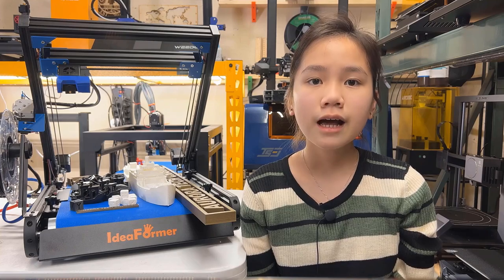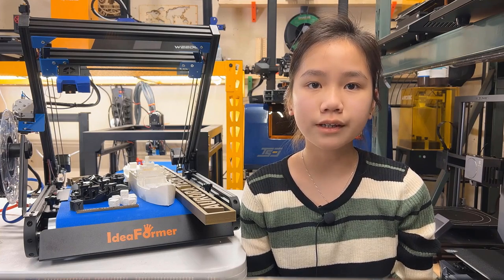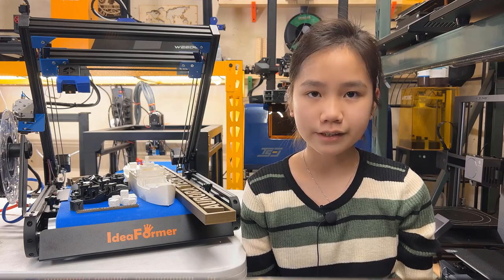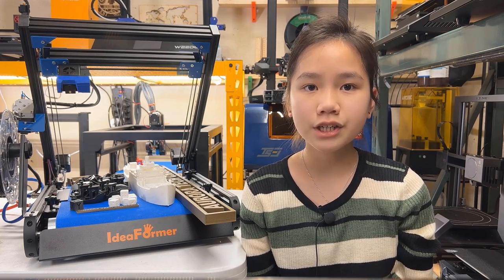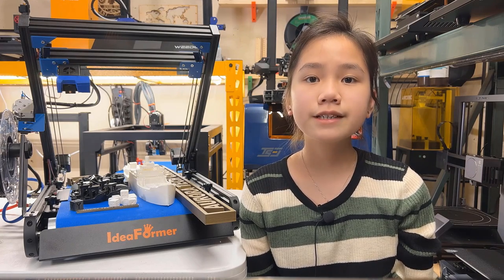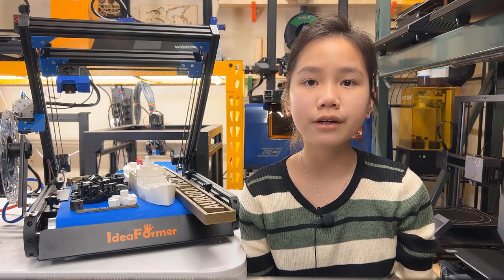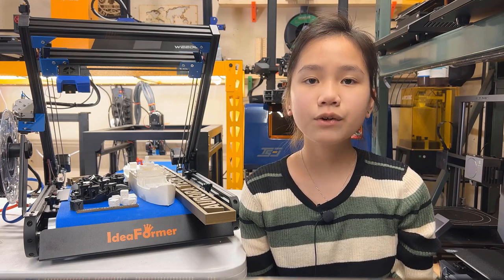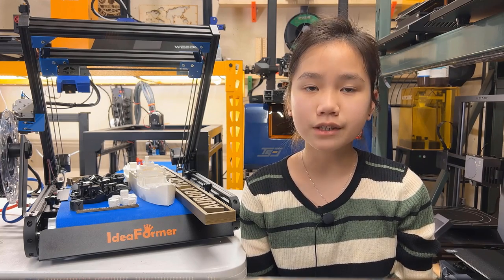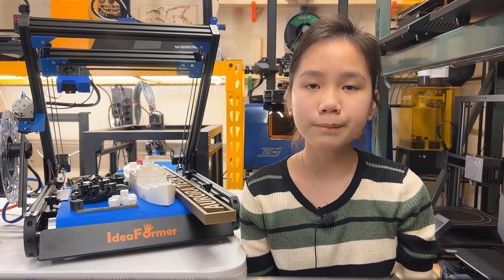In conclusion, I am quite happy with the build quality, the linear rail core XY kinematic, and the belt is aligned perfectly. I don't have to do any adjustments, just spend some time doing bed leveling and adjusting the Y-limit switch height. Of course, you still need to slice the model at an optimal angle for it to print well. If you are a beginner, it may not be the best idea to get this as your first printer, especially if this will be your only printer.